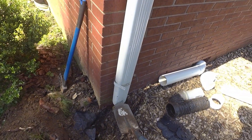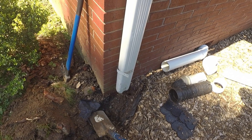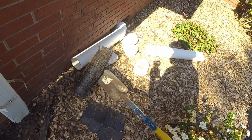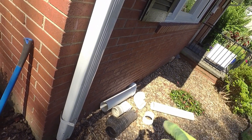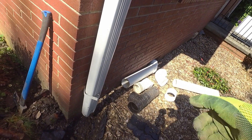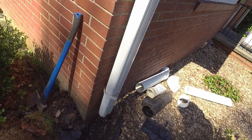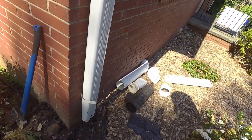What we had was water coming out of the gutter into a T-junction. One side of the T was going into a pipe intended to carry water away, probably in that direction. But because of the way the slope is, it was actually going into the other side — the French drain type corrugated pipe with holes meant to collect water. That was letting gutter water flow into the French drain and sit against the wall, causing the basement flooding. We're going to leave the French drain intact because now that we're moving the gutter water in a different direction, it can act as a proper French drain — an enhancement instead of a detriment.